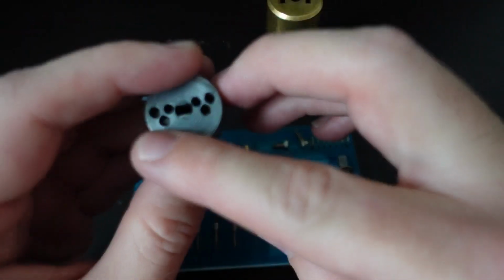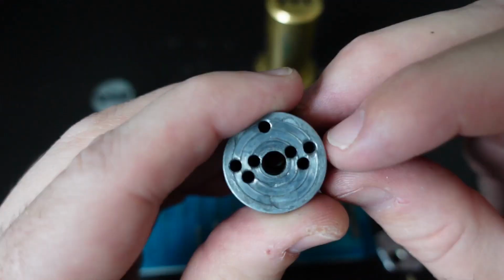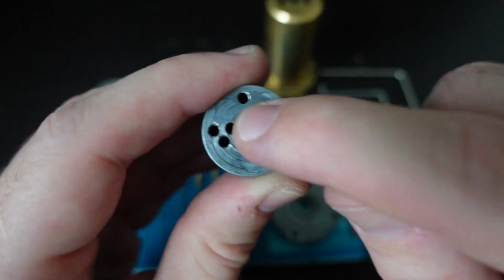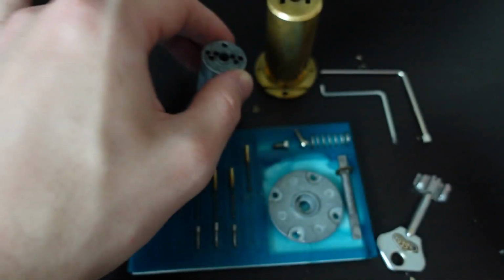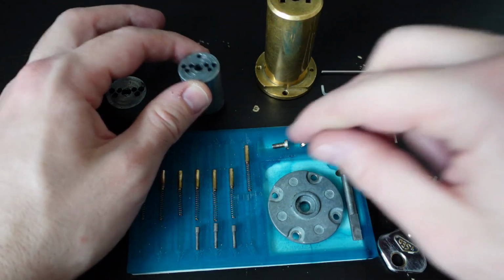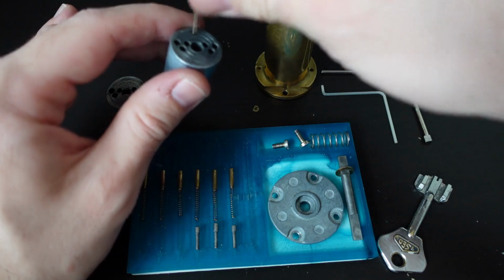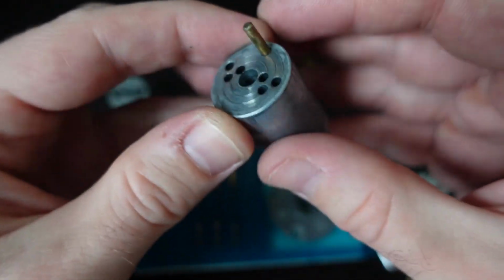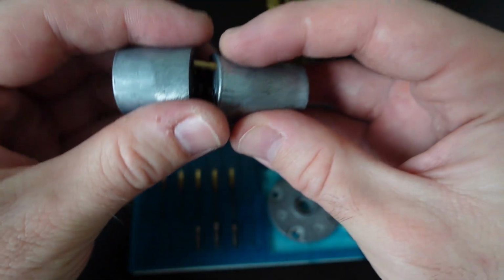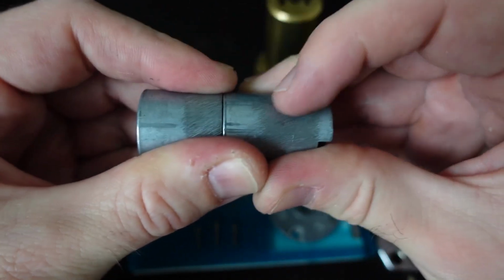And you can see that we have 6 chambers for key pins, but 7 chambers for drivers, sort of. And indeed, this one is actually the trap pin, and probably the most difficult part of this lock. The trap pin works basically like this. At resting state, it's just chilling inside of this chamber. It's just pushed like this, and it doesn't have a corresponding chamber in the core, of course.